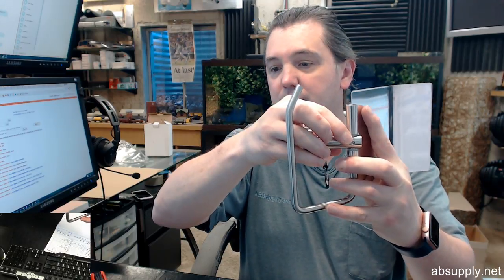Looking through the balance of the specification paragraph, it states that the roll holder bale is retained on the post with a concealed screw, which is here. The hood is captive on the bale. The post is 22 gauge tubing with an 18 gauge threaded bracket.